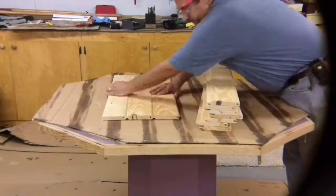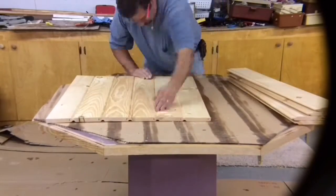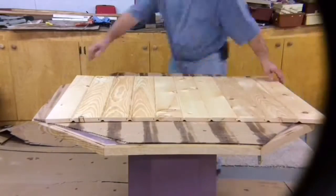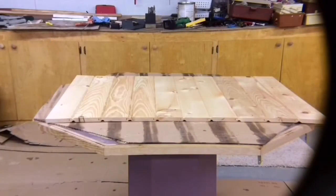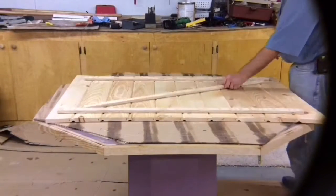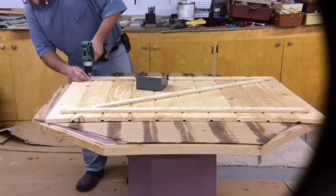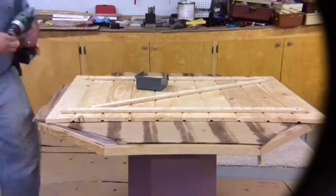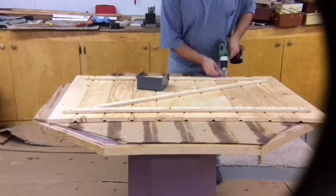It's time to do the assembly. I went ahead and assembled these out, and I did not glue these at this time or use the construction adhesive, because I'm kind of doing these as a temporary setup just to test them. The plan is this winter I'm going to go through and disassemble these and build them more rigid. I'll go ahead and glue them up with better support brackets, maybe some metal corner brackets to give it some more rigidity. This was really more of a test just to be able to get this thing on the road using what I had. I'm just using little pieces of cutoff scrap to give a little bit of Z-bracing on this, to give it a little bit of strength and hold it all together.